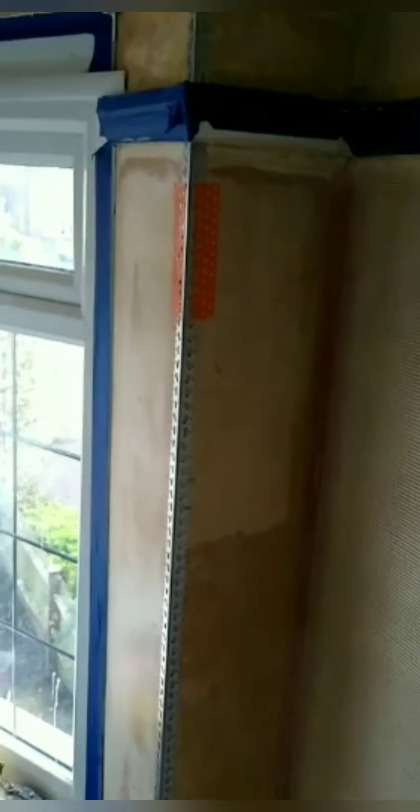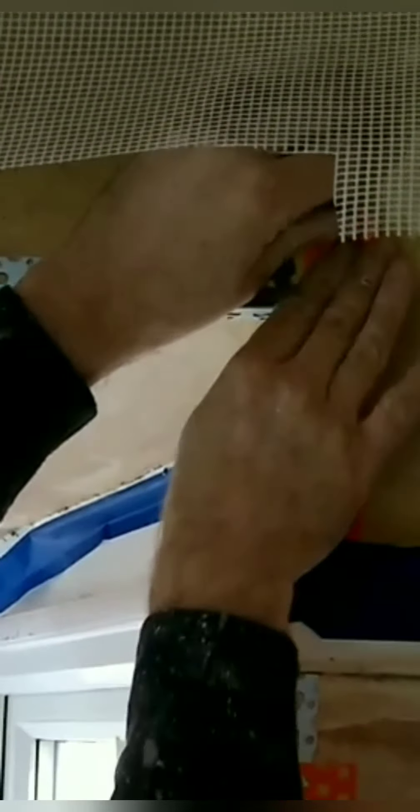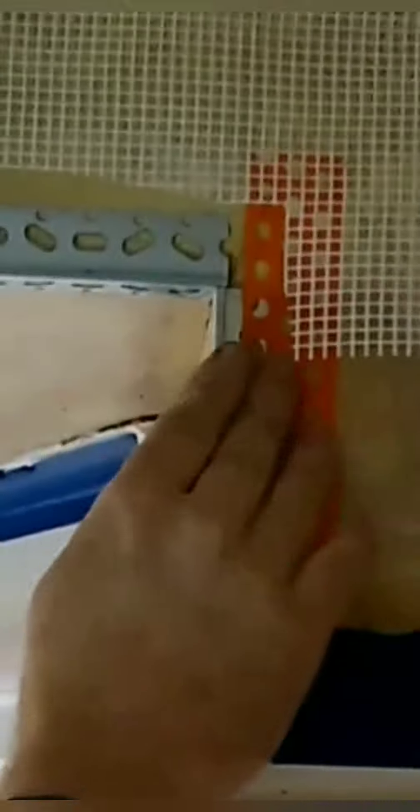We're using it where we're struggling to get a staple in or the nailer. Sometimes we'll use the 30mm brad nails, but these corners are too strong for that — the sand and cement corners are too solid, even for the brad nailer. So what we find is if we glue it and allow that glue to completely dry, and then literally stick them on. It's really fast, isn't it Matt? It's much better than pins that don't go in the wall. As long as the glue's dry, it sticks up. It's got quite sticky stuff — it's fast, it's really good.